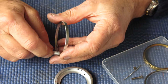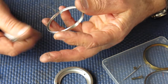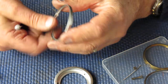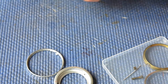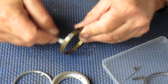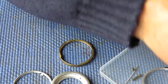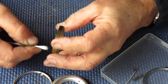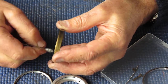This aperture ring has a return spring to help return it to the neutral position. Interestingly, on the Voigtlander Besamatics — which use a very similar shutter to this — they don't have that spring at all. They lack it completely and yet appear to work completely normally.